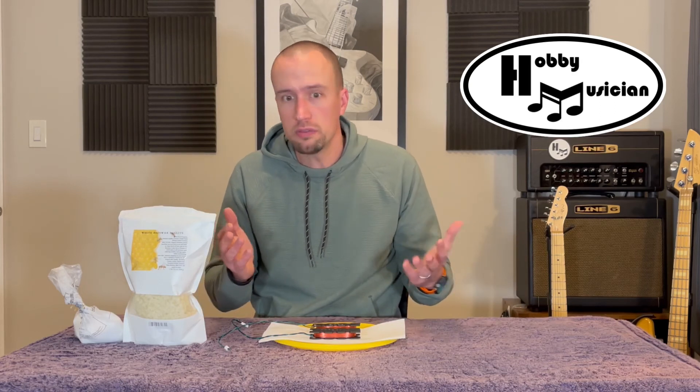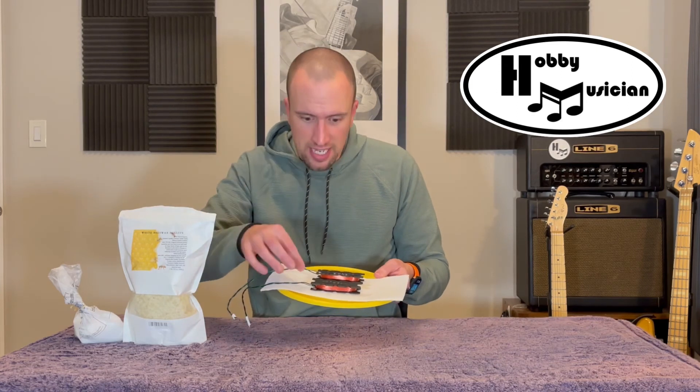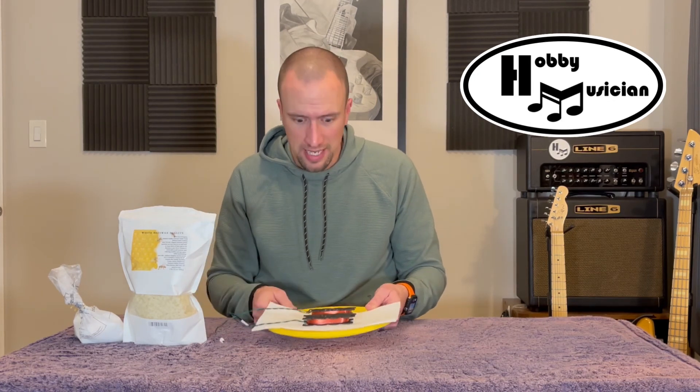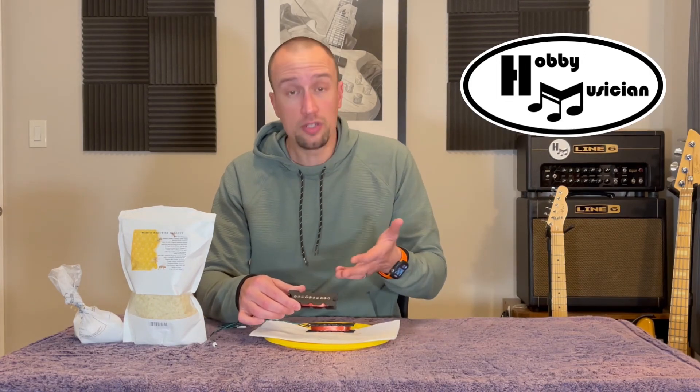There you have it — they're all done! The 15 minutes elapsed, and as you can see in the time lapse, every few minutes I'd shake them a little bit to encourage more bubbles to come out. When there were no more bubbles, I reached in by the wires, pulled them out, gently shook off the excess wax, and laid them on the plate to fully dry. As for cleanup, there's a thin coating of wax on the outside, but if you wait till they're fully cool you can come back with a plastic knife to scrape off any extra wax.